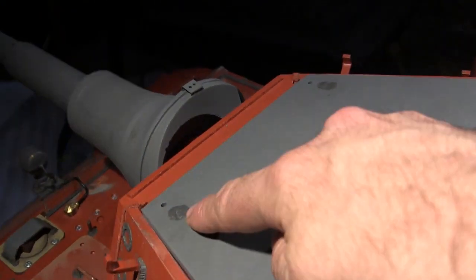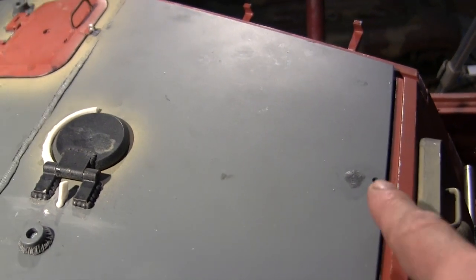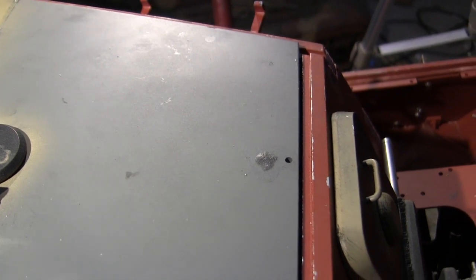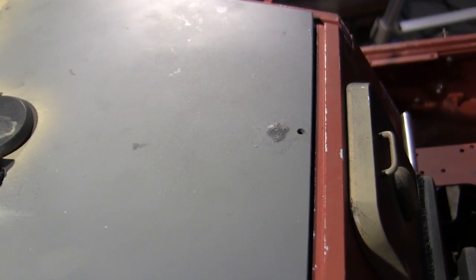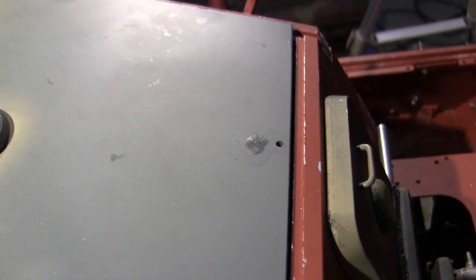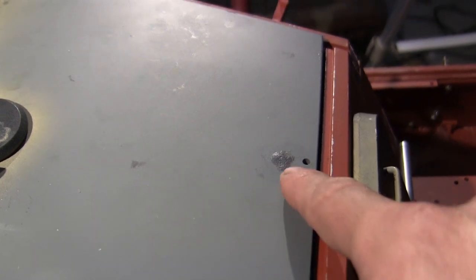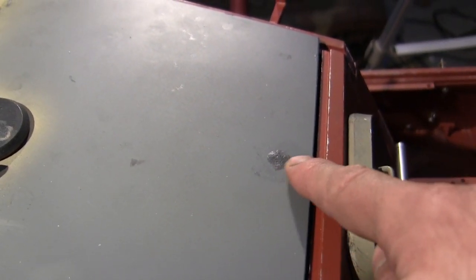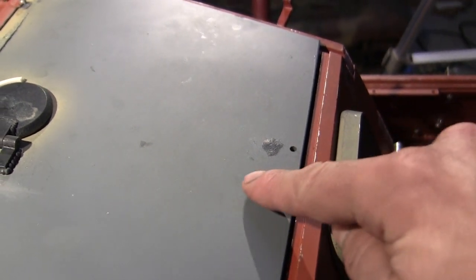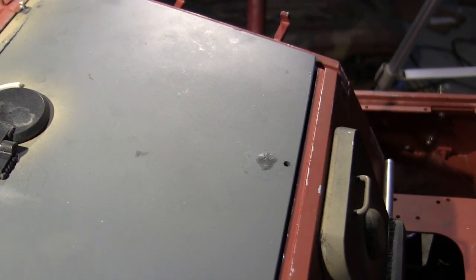The next thing I briefly want to touch upon are the lift hooks found on the front as well as on the rear. The kit does have these sections integrally drilled into the plate, however in my opinion they're a bit on the smaller side. So to fabricate new ones I'm just going to drill a new hole into the plate in a new location. One of the existing sections is not going to be used so I just plugged it up with epoxy. After the epoxy sets I'll sand it away nice and flush, drill a new hole, and then fabricate the new lifting hooks.